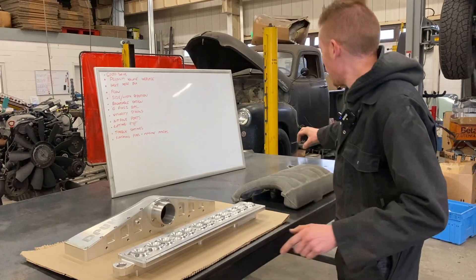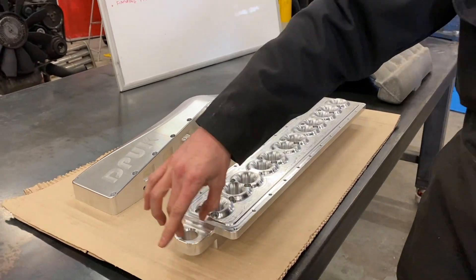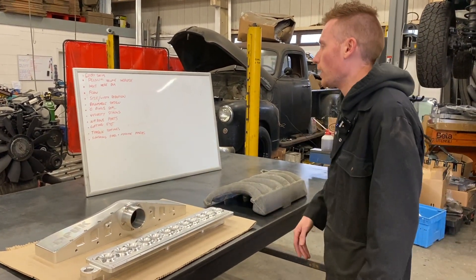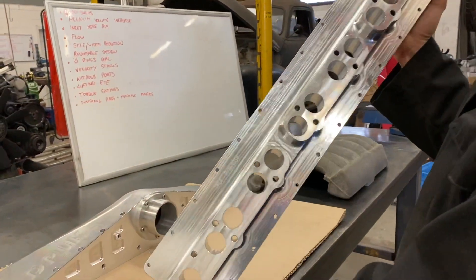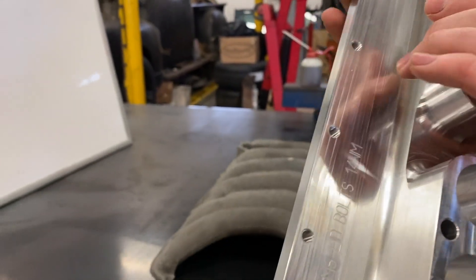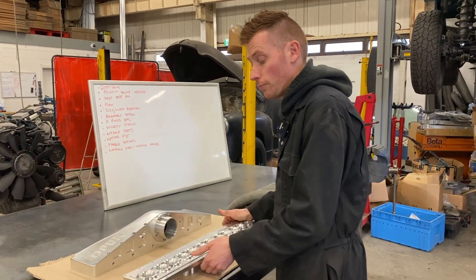The original has a lifting eye at the back — that's part of the casting. This is literally a lifting eye. If you have a clearance issue in your vehicle, chop it off — you don't have to use it, but that's where we put the lifting eye. Torque settings — obviously important. If you're taking it off or putting it on, we've put it all on here. You've got your M7 flange bolts for the head at 17 newton meters, M6 lid bolts — which go all around the perimeter of this lid — at 14 newton meters. And that's our unique part number from the manufacturing process.